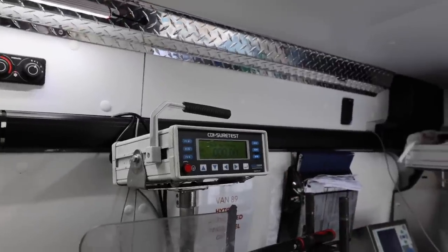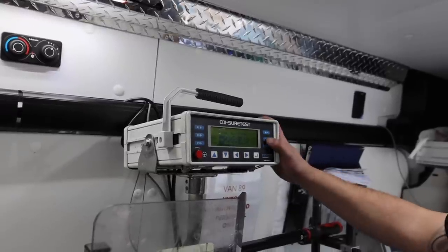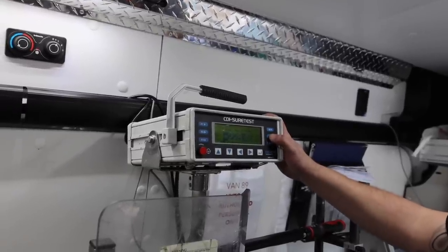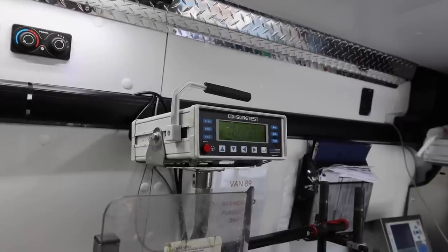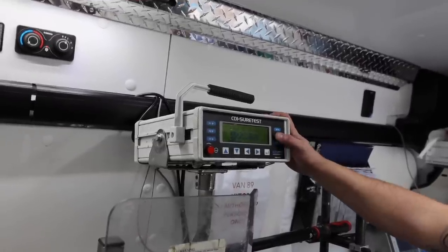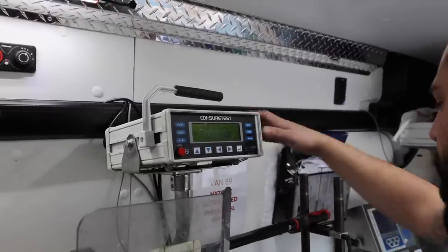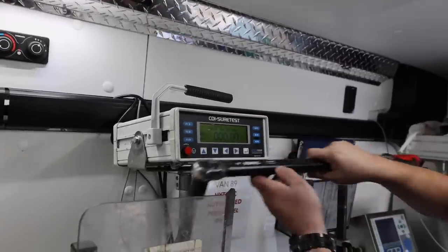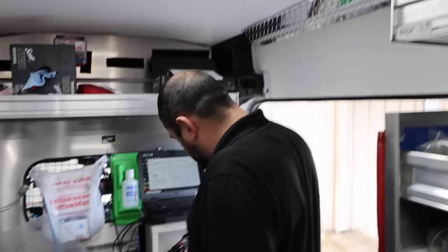So that means it's 28 foot-pounds off? Newton meters, or 28 newton meters off? Yeah. And it was roughly 5 short on the 80? Correct. The higher you get, the more you're allowed to be off. Yeah, because the numbers increase.